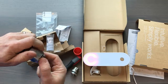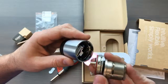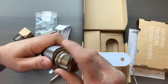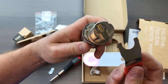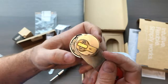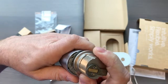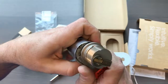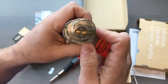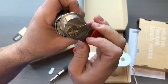Go ahead and put the battery back in, making sure it's polarized the right way. It will start beeping to tell you that you got it right. Now that I've got that MAC number, I can go ahead and install this on there. Put this in the right way, push it all the way down, and then you've got this little shoehorn-looking tool. This slides inside and you can see there are little grooves all over — it's got four of them. The little teeth on this fit into those grooves. Once you fit those teeth in and push the two together, you can slide it until you can see that little hole. That's where I'm going to put that tiny screw, so someone can't come up on the outside and just remove this. Put that screw in there — that's very important.